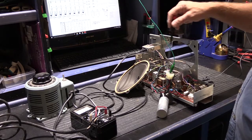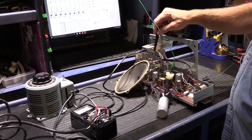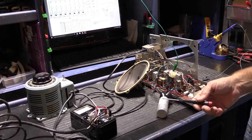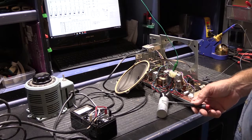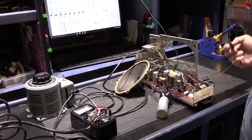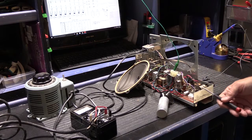The primary problem with this unit was age. We had a couple of bad vacuum tubes. There were a lot of bad old-style tubular capacitors. The primary electrolytic can capacitor — this is a three-section can capacitor — was in really bad shape with a lot of leakage in it. There were also a couple of small electrolytics, and of course like all of these sets when they come in, a whole lot of really bad solder joints on the bottom of the board.